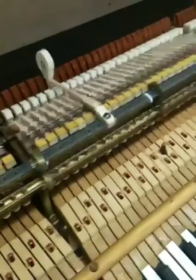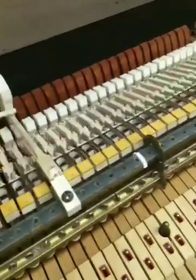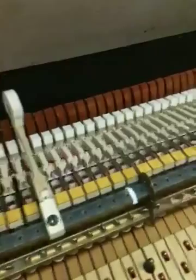And that's really been the problem — people aren't using the right parts. There are a lot of pianos out here like this. So instead, what normally has been done is people are now saying you have to get a new set of shanks, re-glue the hammers onto them and get all new parts. What I'm doing in this situation is putting on new knuckles.